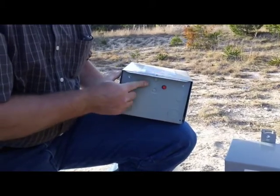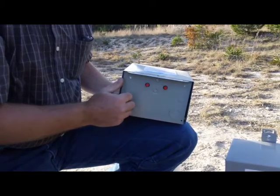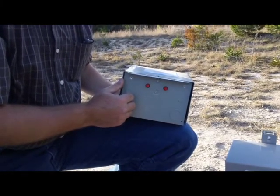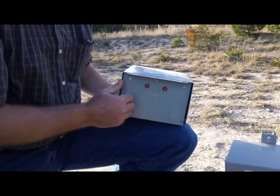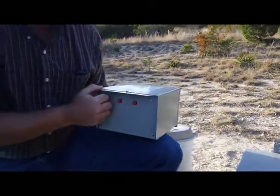If you have a reset button, you can push on it to see if that kicks the pump back on. If you hear a definite click, you'll know that the pump was cut off for that reset. The other things you can check are your filters to make sure the filter's not clogged, or to make sure that the valves are open to the house.